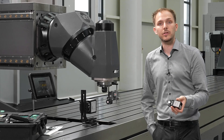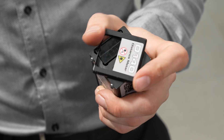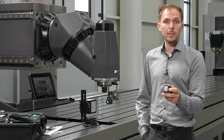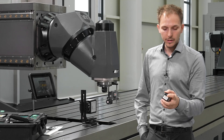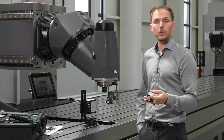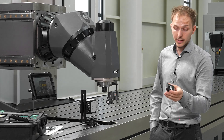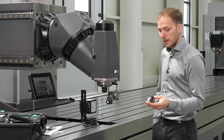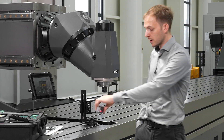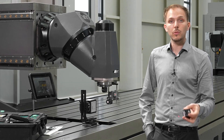This device is pretty easy to use. In the front is the aperture where the laser comes out, and you can turn the little cap 180 degrees to release the battery and put a new one inside, then turn it back 180 degrees. On the back is a button for switching it on and off. It has three feet on its bottom for a good stand, and one of these feet is movable by a screw for alignment.